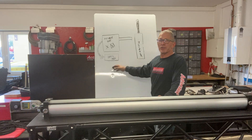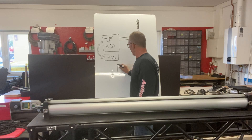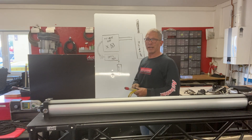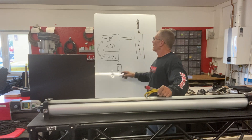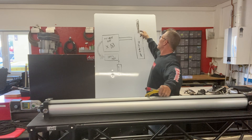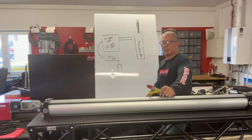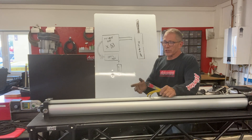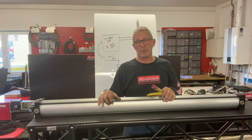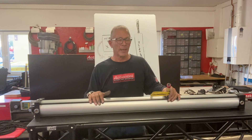To fill your accumulator, you're going to use some form of pressurized gas — a high-pressure fill tank usually. You put air from that into your accumulator to whatever pressure you've calculated for weight and distance. It's armed, you push the button, it pushes air into the cylinder, which retracts the rod or cable, thereby pulling the rope attached to the end. Pretty simple. We use 4-inch and 5-inch cylinders. In front of me is a typical 4-inch cylinder. It's really straightforward.